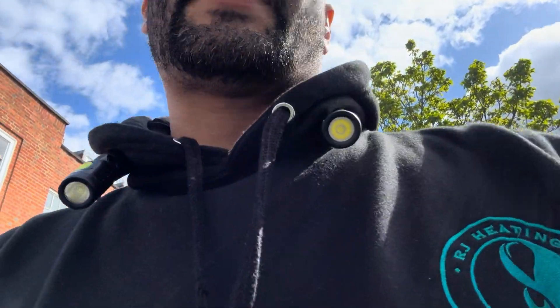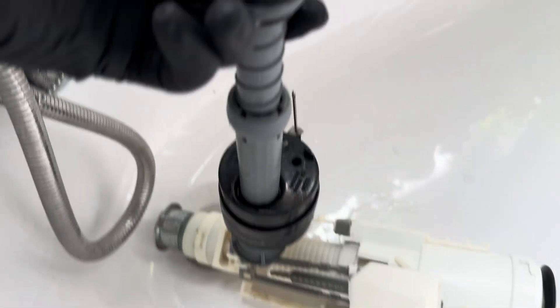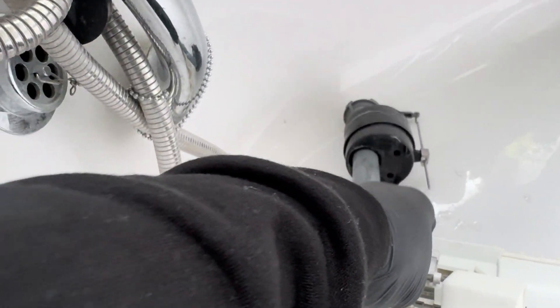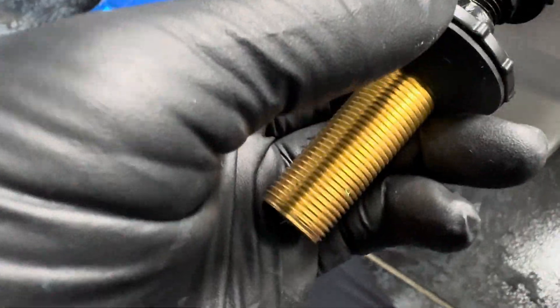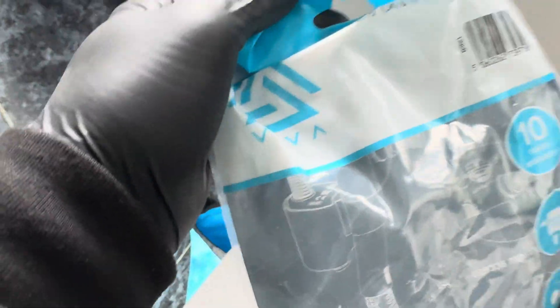So it turns out it wasn't a half-inch shank — look at that fill valve. I've never seen that type and the hole is too small to fit a half inch. So I've got this Viva one from Toolstation, which comes with a half inch and a three-eighths, so I'm hoping it's that. Fingers crossed. Here's the old one — let's see if that's the same size. It looks roughly the same. That's the one — this just screws into the bottom and you can either have three-eighths or half inch, which is quite handy. That's a little Viva — Viva Sky Flora, I believe.